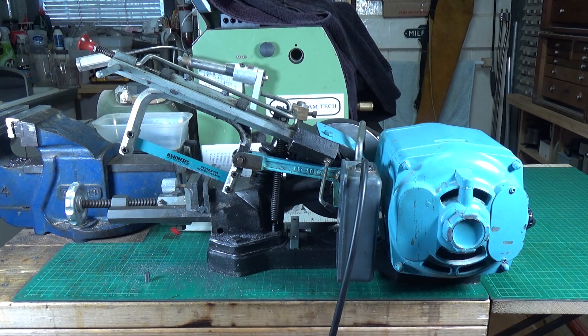We've achieved what we set out to do: it's got a new belt, it's all been cleaned up, it's got a new saw blade, everything's been oiled, and now it's got a decent adjuster for the tension. It was a pain to do it all, but this is such a useful tool, and even the fact that you've still got to fiddle around to get the belt tracking right doesn't matter — it's worth the time spent on it. Anyway, I just thought I'd do a quick video on this. If anyone else has got one of these and they're having trouble adjusting the belt tension, that's quite a good way to go. As always, thanks for watching — cheers.